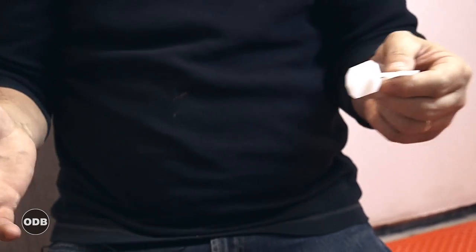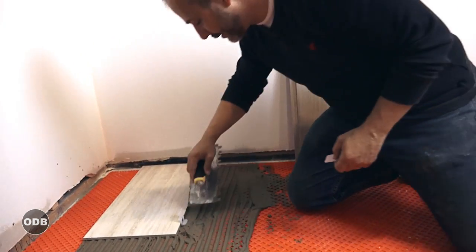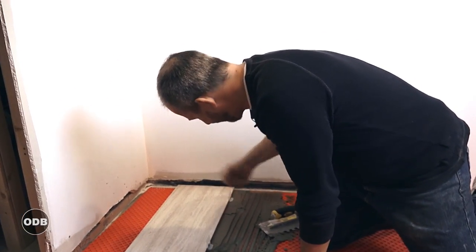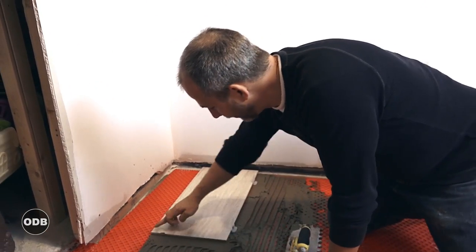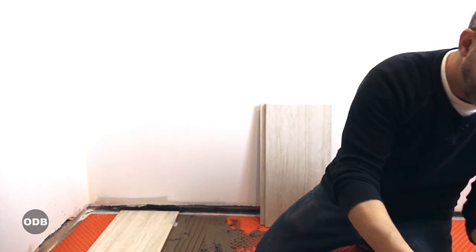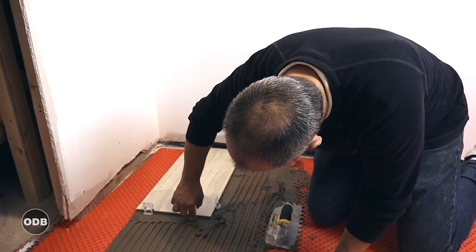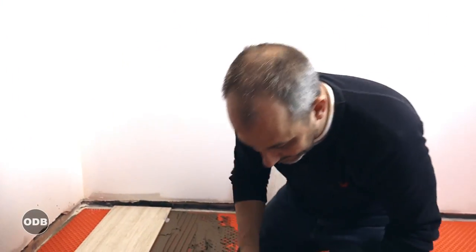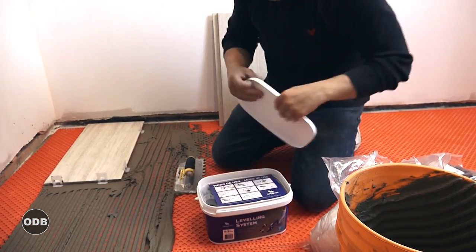It's a clip — basically the same science as all the clip systems. They break off, you put them underneath the tile. You just place them underneath; the idea is to get rid of the extra cement in the area because you don't want cement popping up between the joints. Some people use a margin trowel — I'm a little old school, I like to have one tool in front of me, so I use the trowel. You want to get it level in all directions.